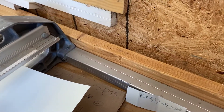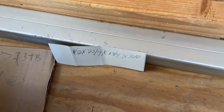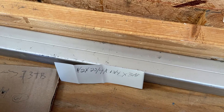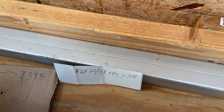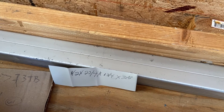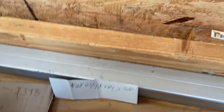I'll shoot a video and let you guys see what I'm doing. You go up and measure the window for what you want your metal to be. That first half is my hem, then two and three quarters is the distance out, then one and three quarters over, and then five eighths to the siding. So there's my measurement.